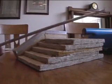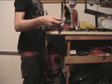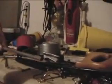Okay, so now the bending part. The next thing you'll need is a vise. And this is kind of hard to do with round coping because you can get the bends off, so it won't be even. One bend will be here, and then the other one will be here, and it'll look weird, and it won't work at all. So you have to be really careful to make sure your bends are lined up. And if you don't have a vise, there's another way to do this. What I did the first time is you can take a drill, the same size as this, and drill a hole through a table or something you don't care about, like my workbench. This was here for the vise, so I just drilled it out a little bit bigger. And then you can just shove that in there and get the bend you want. But a vise works better, so use that.